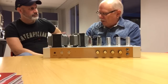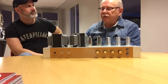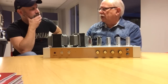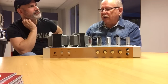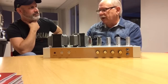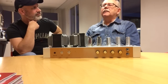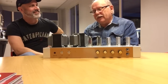The thing was very simple. The error I learned later, I was instructed by somebody who looked at my great construction and said, well, this Russian TV power transformer is not capable of delivering enough current to your amplifier. So it's running out of current and distorts in the power stage. So I had power amp distortion. I didn't know I had a golden egg.